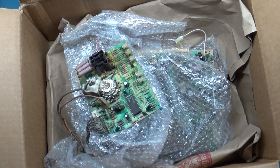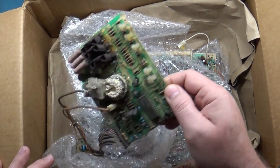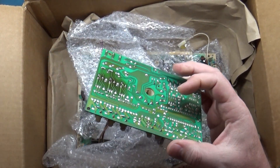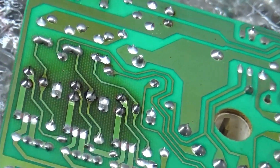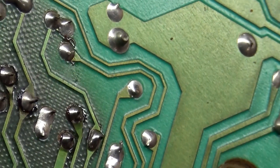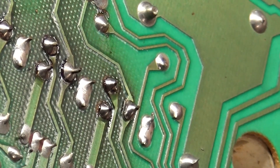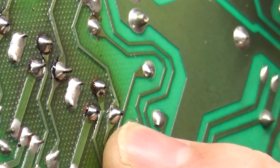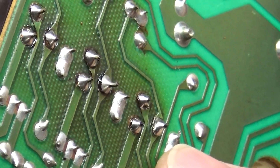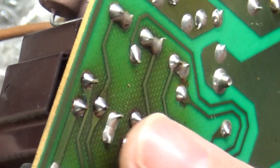If we look at this, it's just kind of haphazardly packed in here. The neckboard isn't protected at all, but it seems to be okay. The traces and everything on here aren't really broken. This one here is lifted a bit, but nothing really detrimental. That solder joint is just broken off the trace. The other two are somewhat intact, and the blue on the outside — I think that's broken as well on that solder joint.